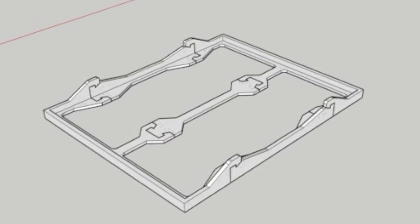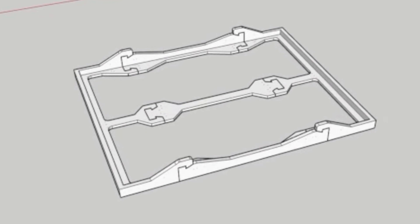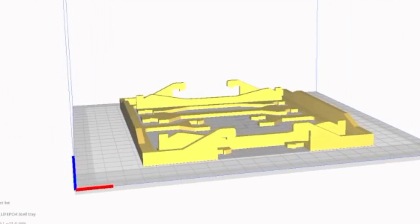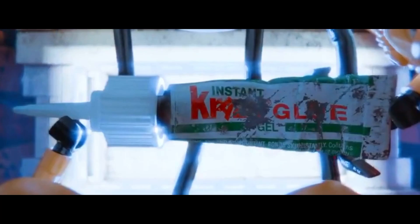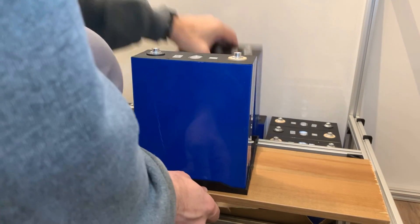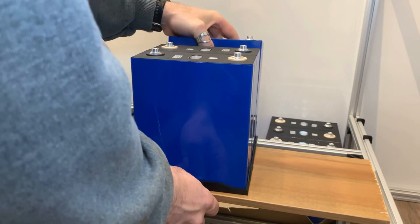I've started with several 3D printed parts. I designed the part in SketchUp, but the finished size was slightly larger than what my printer can print, so I modified it to fit together like a puzzle. I sliced the model in Cura to create the g-code and printed the pieces on my Ender 3 V2 using PETG plastic, which I then glued together using cyanoacrylate glue. I can now place three cells into each tray and they're held precisely in the right spot, giving me consistent and accurate spacing between the cell blocks.